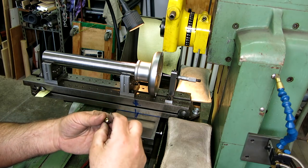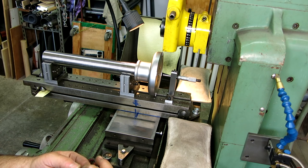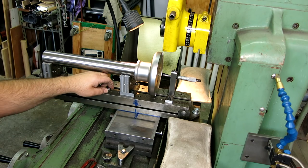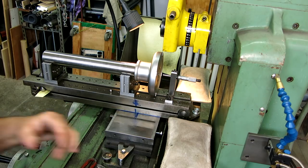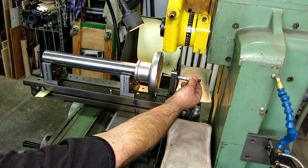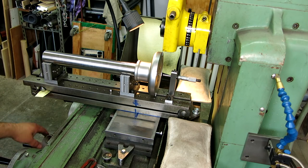I used some extreme pressure lube to kind of glue it in there. Okay, so anyway, I'll come up with something a little bit better. Maybe I'll cement it in there temporarily. And then that's going to run on the end of this micrometer here. It's just a 1-inch straight micrometer. And then I can actually dial in my grinding here too, a little bit at a time, and then come up and work with that. I can also use the cross feed too, although once I get set up, I may not want to do that. We'll just use that. So anyway, that's kind of the setup.